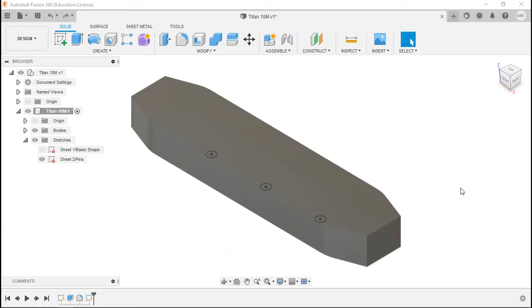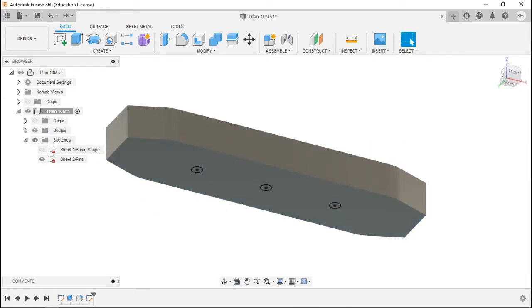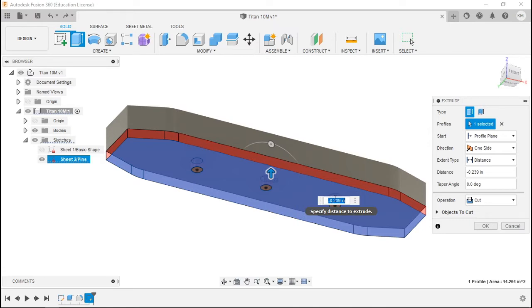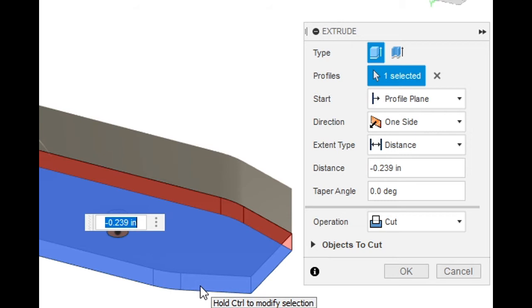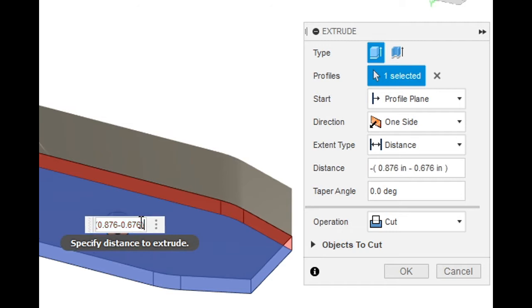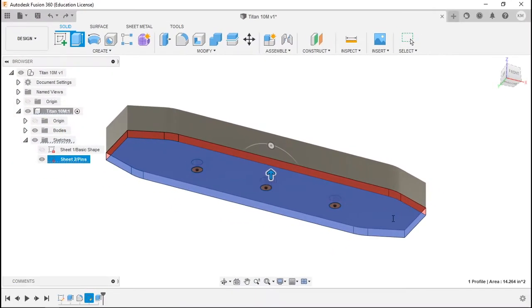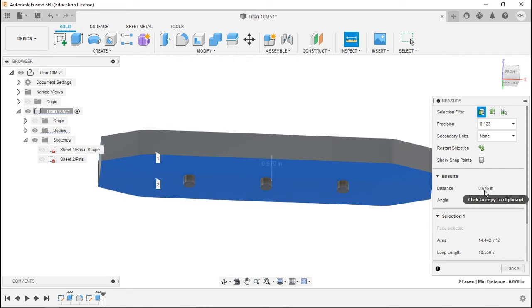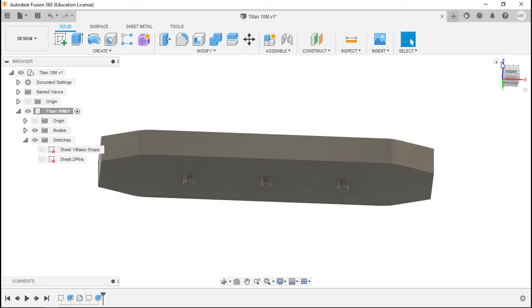You may be wondering how much to extrude this part by. We have a pin depth of 0.876, and we need to extrude that away until it is 0.676. We'll do the math inside Fusion: click drag up, then in the extrude distance box type in negative bracket 0.876 minus 0.676 close bracket. Enter. That does the math for us. We can verify with Inspect > Measure between the two faces — we should have a dimension of 0.676. There we go. Sheet 2 is done.